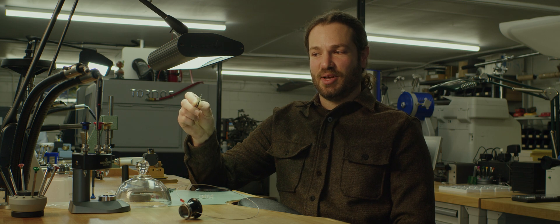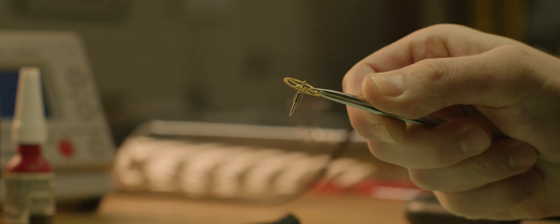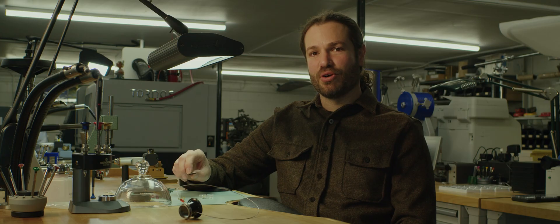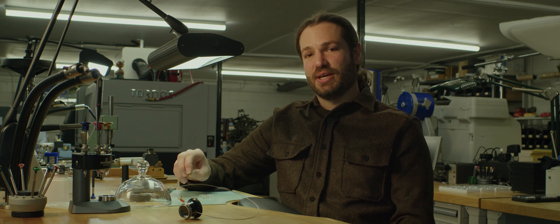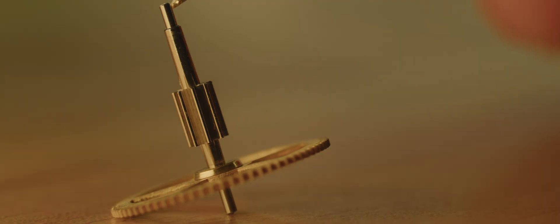You have wheels like these that help transfer the power. The wheel is the brass part — in this case it's brass — and the pinion is the axle of that wheel. The wheel has many teeth; the pinion has just a few leaves. You should have one tooth profile for the wheels and a different tooth profile for the pinion leaves. So a wheel interacts with a pinion that is the axle of the wheel.